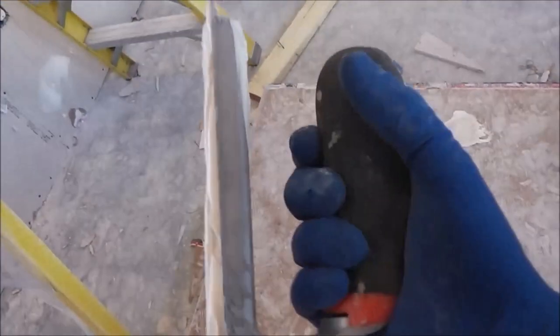And you really rarely ever see when people are doing drywall, it's really a mastic application trowel, and I find it's excellent. I don't use the notch side, but the non-notch side is so thin and flexible. So when I go and put on the seam, I lay on the fiberglass tape first, and then I make sure to mud it up real good with a regular putty knife, a wide blade 4-inch putty knife.